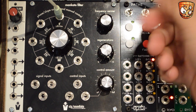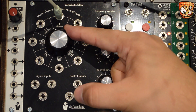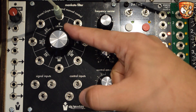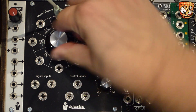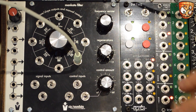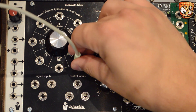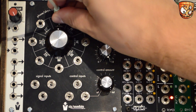For now that's it for the filter. Let's take the signals out and turn up the resonance so this starts to self-oscillate. We get a slightly imperfect sine wave from the 6dB slope — it's got a slight harmonic content and a different colour. The other outputs are nice sine waves, while that slightly coloured sine is on the 6dB output.